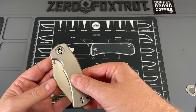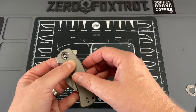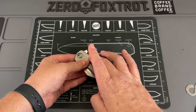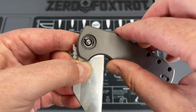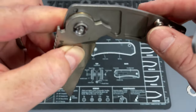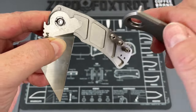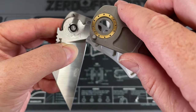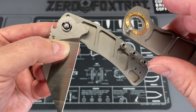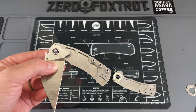This is basically your lock right here on the internals — a really cool concept. They did a great job getting this milled in here. It's part of the pivot and it just slides back down in here. Put it back together in reverse order, making sure you've got everything lined up and your spring tension seated. The best way is to get this in position and then push it down. Then put your top scale back on. It's a very simple disassembly once you figure out how to get something in that slot.